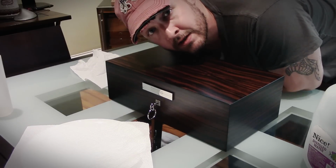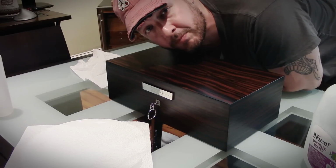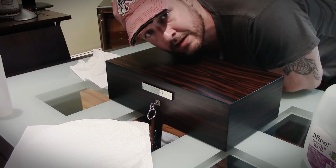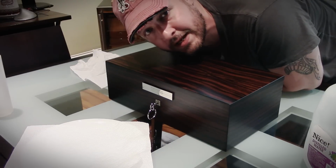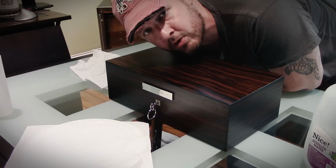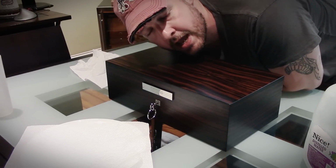And you're still going to need to wait those 4 days for the wood to completely absorb to its capacity. That's the secret, to not have any really dry wood left, that the water has been absorbed into the wood. Wiping it down does not really speed up the process. It only potentially causes damage later on, such as checking, splitting, cracking. Water and wood do not mix. Do not wipe down your humidor. Whoever started that trend wasn't thinking, okay?